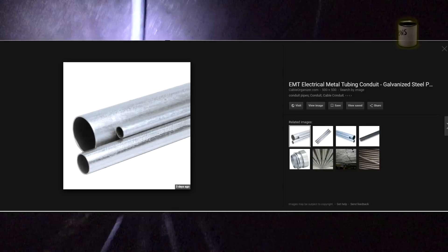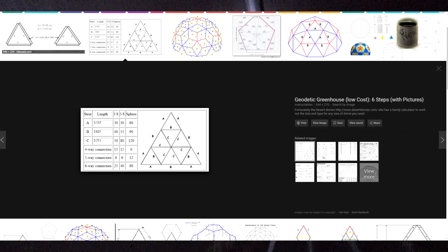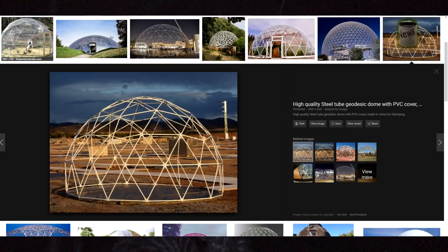Let's see the entrance right here — we got all our stuff in here, as you can see. This geodesic dome is made out of half-inch EMT, half-inch metal electrical conduit. It's very simple and easy to make. You cut the spires to length, then flatten out the ends and drill a hole in each end. You just take a bolt and put it through — that's how you hold the whole thing together. It's simple, cheap, strong, and light.